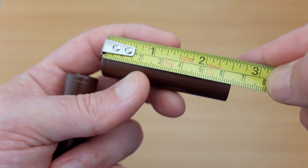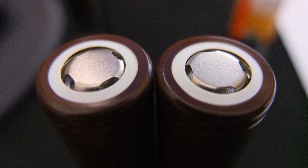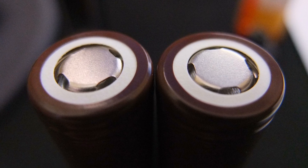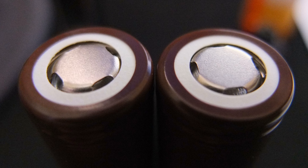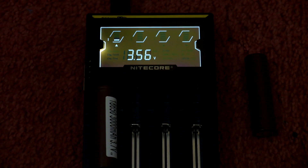Size-wise you're looking at about 64 millimetres. When spotting fakes, I would look at the crimping at the top of the venting terminals — the terminals should also be slightly higher than the wrap on the case, only fractionally, not pushed in. Also pay attention to the white ring or washer: it shouldn't be smooth, you should have a texture on it and it should feel matte when you touch it. Some of the fakes I've seen have a smooth washer and poor crimping — that's a good way of spotting them.